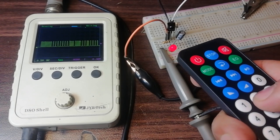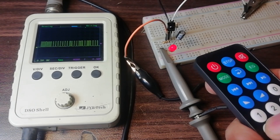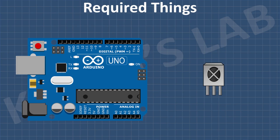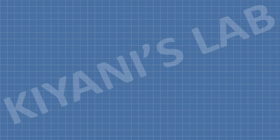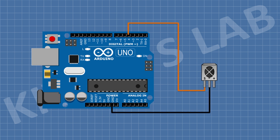As you can see, we are capturing different buttons and different commands. So first we need to receive and decode the commands of the buttons that we are going to use. For that I'm gonna use Arduino and an IR receiver. Now let's do the connections for this setup. First I'm gonna connect the Arduino, then connect the IR receiver and connect its pin number 1 to pin D4 of Arduino, and its pin number 2 to ground. After that connect a 100 ohm resistor and connect one pin to pin number 3 of the IR sensor and its other pin to the 5V pin of Arduino.